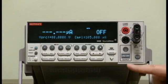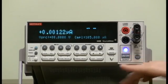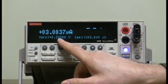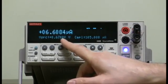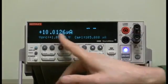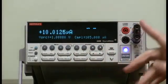All we have to do now is hit output on and sweep. And if you notice, it's sweeping pretty fast — there it goes, 10 millivolt steps. It should read about 10 microamps, because it's one volt on 100k.